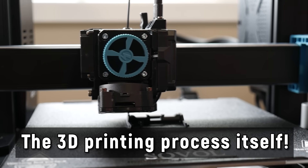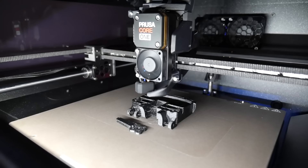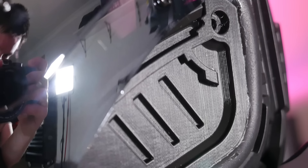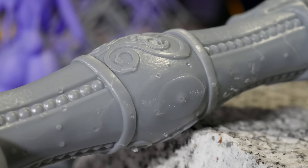Number 8: the 3D printing process itself. All 3D printing processes are additive — they create physical models layer by layer through the addition of material — and simply due to the process they have a hard upper limit when it comes to accuracy. You can't get a perfectly smooth surface; it's always going to be a division of those layers. It's frankly a marvel of engineering that FDM 3D prints are usable at all, but with these tips hopefully you can get even more precision out of your parts. Other technologies such as resin printers can resolve higher detail but have their own issues with part shrinkage and warping during curing. No technology is perfect, but if you know what to expect you'll have a much less frustrating experience.